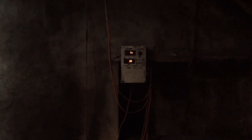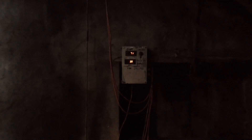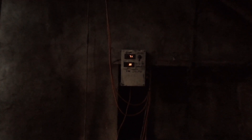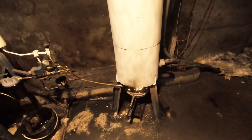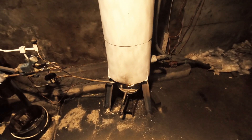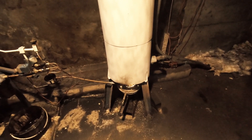Water leaving the boiler is 71°C and the return is 39°C. If we had a flow meter we could work out the kilowatts of heat output. It burns 2 litres an hour and up to 18 hours a day depending on outside temperature.